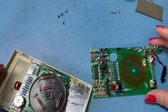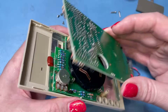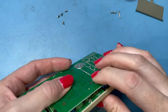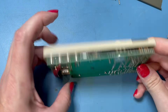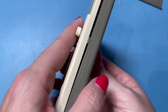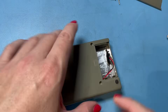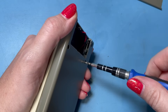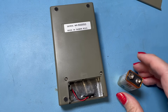Let's pop it back together then. I'm going to put a battery in this and put it on the scope to see what we can do with it. We've got to get these pin headers lined up properly so we don't smoosh any pins. Let's get the screws back in. Now just put the back of the case on - there's just a little plastic clip on each side and two on the top. Nicely snapped back together, two little screws to go in. Because we're going into plastic, we've got to back it off slightly until it finds its groove.